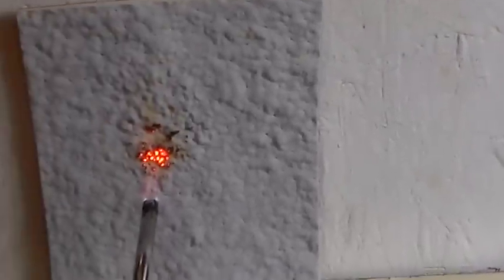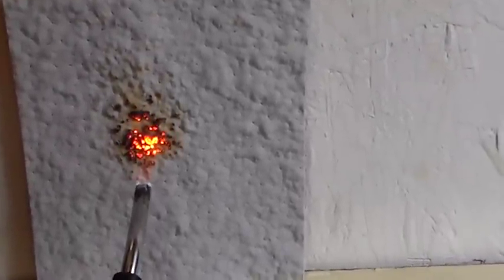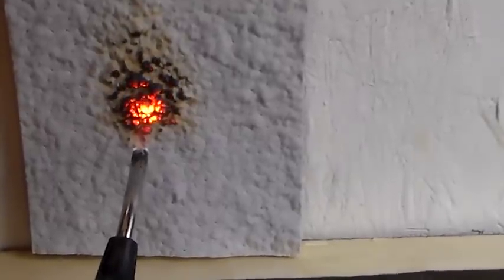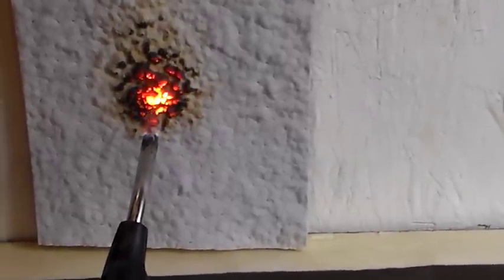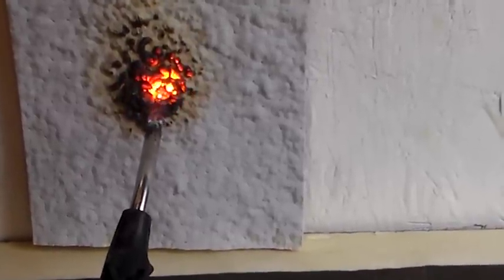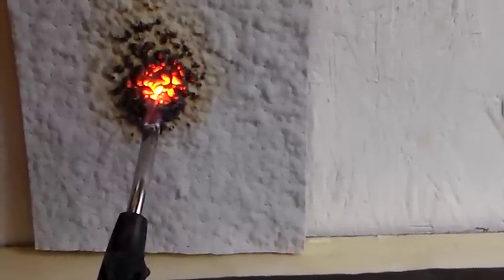This piece has got about two coats of the DC315, and the flame hasn't been adjusted at all. You see there's no flare up whatsoever. This is an intumescent, so it's going to char and the paint coat is going to swell up and form a layer of charred coating that's going to protect the substrate.